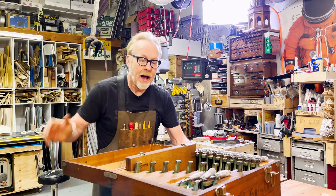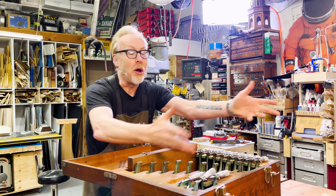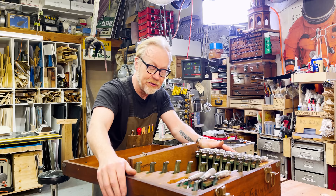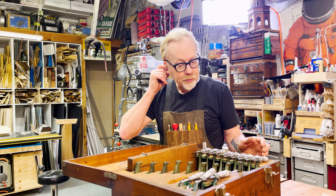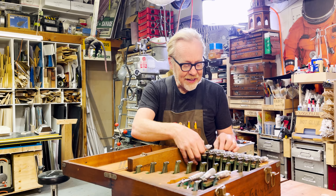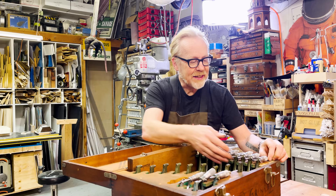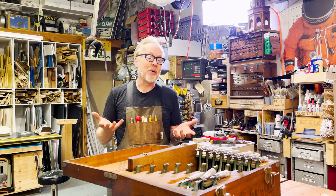I got this on eBay. Whoever shipped it to me was less than careful about shipping it, and it arrived with the plywood falling out and all of these literally tumbling around in this box. I was mortified — I thought I'd received several hundred dollars' worth of worthless pieces of metal. However, the other evening I spent about three hours all told sitting at my dining room table with some mineral spirits, light machine oil, some Q-tips, and wire brushes, and I adjusted and calibrated all 12 of these micrometers. Each one of them spins beautifully and smoothly, and they were all within one thou of calibration anyway — that speaks to what excellent tools they are.